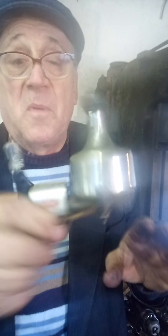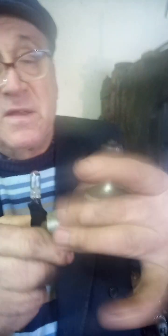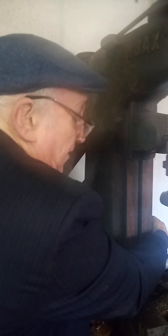I'll reconnect it here — it's a good little robust one. What you have is this spool driving a permanent magnet inside with about eight poles, past a winding. This is a particularly good one. We can't have a bicycle here, so I'm going to put it on my drill press and run it off that.